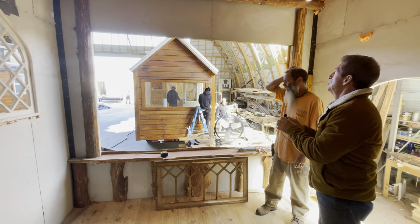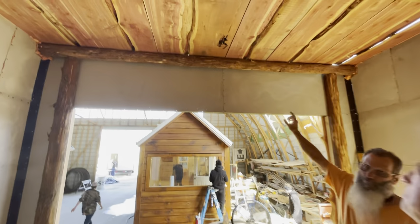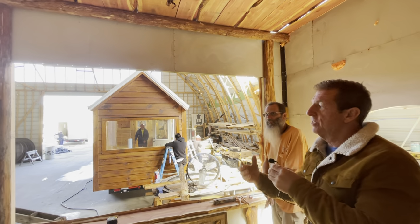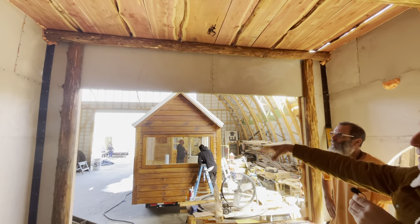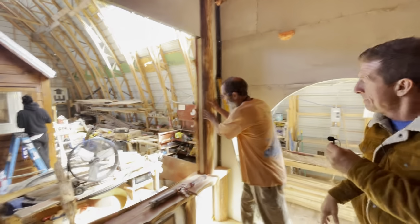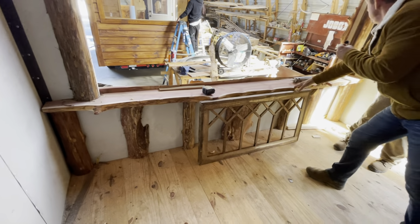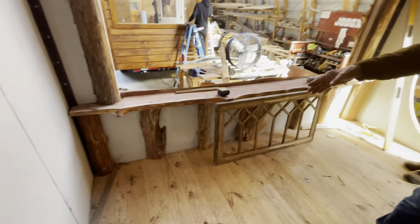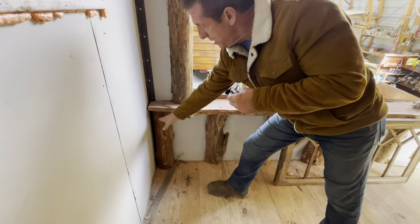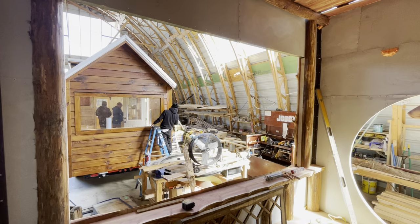And to reinforce the load, you put that up there, didn't you? That, and I'm putting another one on the outside, and then those will get sandwiched together. Bolt them together. Because we're concerned about the vertical load coming on that glass, it's going to have an actual header across there made out of logs. And then all of these are half logs, and everything is supported down to this. This is actually like a header here. Yep, and then those are supports that go to the floor. So this is a big, thick board here. This weight transfers to them, then to the floor. Because that's an 8-foot piece of glass going in there. Beautiful. I love that.